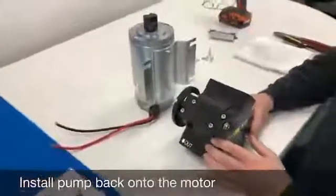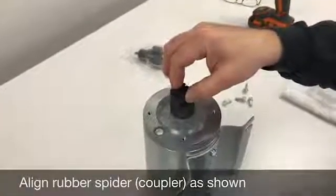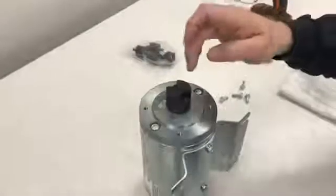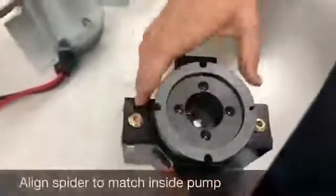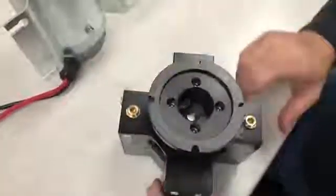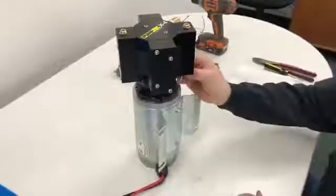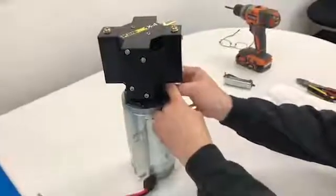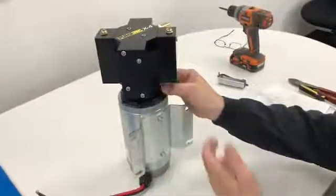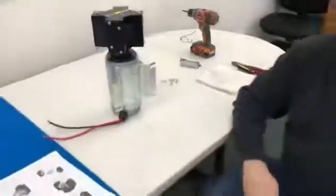To remount the pump back on the motor, line up the X soft coupler — there's an opening here and an opening here. Do the same on the pump: this is the top, so you have your hard surface there and your hard surface here. That way when you put the two things together they line up and the pump slides down into place. Put your four bolts back in and tighten those down — no particular order, you can go crosswise and crosswise. Tighten those all back in place and your pump is rebuilt.